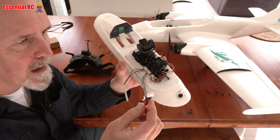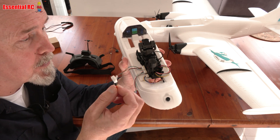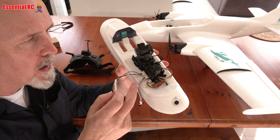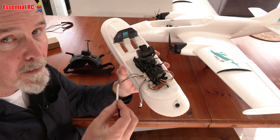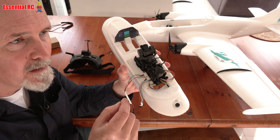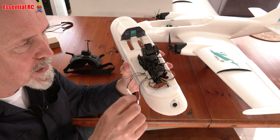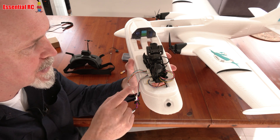You could connect this to a flight controller — as long as it's getting between 2S and 6S volts, that's fine. The other wires on this cable go to PWM channels which give you different levels of control over the gimbal. The first is for selection of different modes, and the others are for independent control of pan, tilt, and roll. However, I'm choosing not to use those — I'm just using head tracking, and with the receiver and transmitter on the head tracker, that works out of the box, which is very handy.